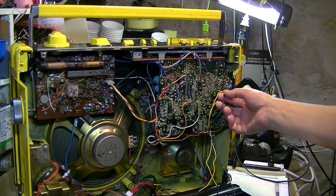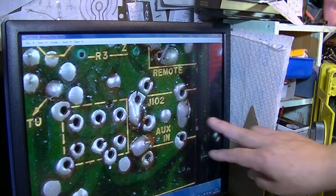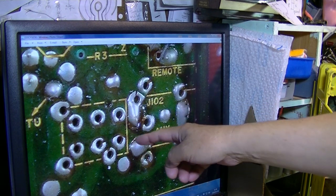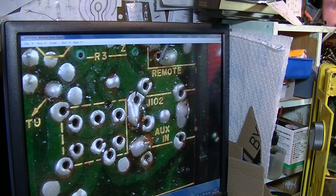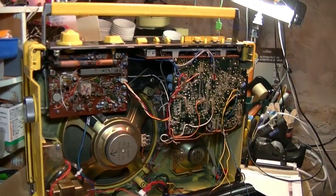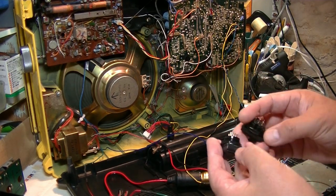So these two pins on the picture here. These pins, if I touch from behind this one and this one, if I make a jump from here to here or here, then even though I attached the tape to separate it, it will play the radio and the cassette. So these two wires go into the switch in here, and this is a switch I use for this Diablo.